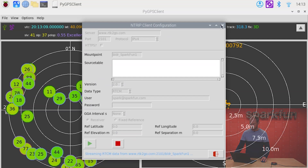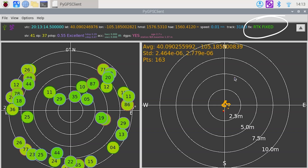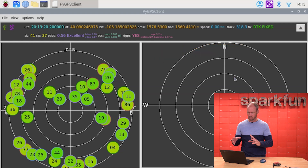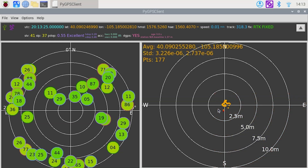Connect up — and we've reached RTK float and RTK fix pretty much immediately. The RTK LED is on. Now we need to zoom in to see what this really means. Another power of Pi GPS Client is the ability to double-click and remove all the previous dots. As we zoom in, this is 1.25 centimeters, which is 12.5 millimeters — about the diameter of a dime. And it's just happily bouncing around in much, much less than 12.5 millimeters — actually around five millimeters. Very powerful hardware, now enabled on a Raspberry Pi.